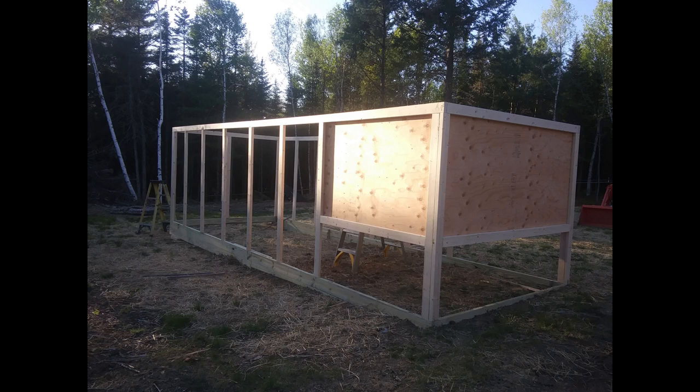The coop itself is built out of half-inch CDX, and we're treating it like an exoskeleton — the frame of the building is outside, the plywood is inside. We came down from the top plate roughly 4 feet and put our 2x4 there, so the plywood is flush at the top and bottom of the 2x4. Then we put an 8-foot sheet of plywood on each end and cut two pieces at 5 foot 11 for the sides, giving us a box — the four walls.